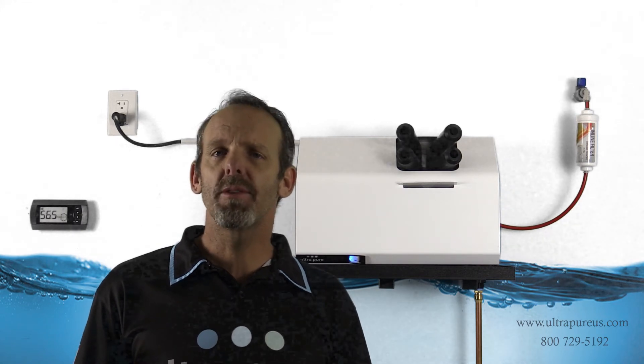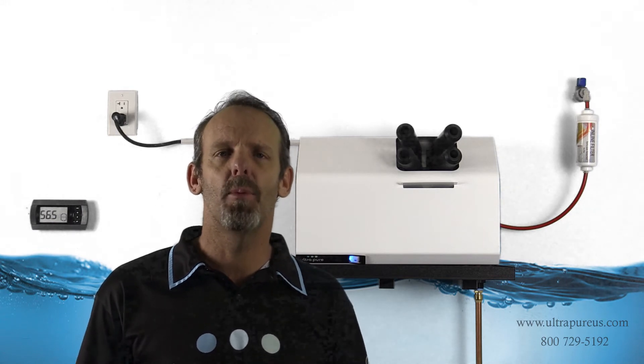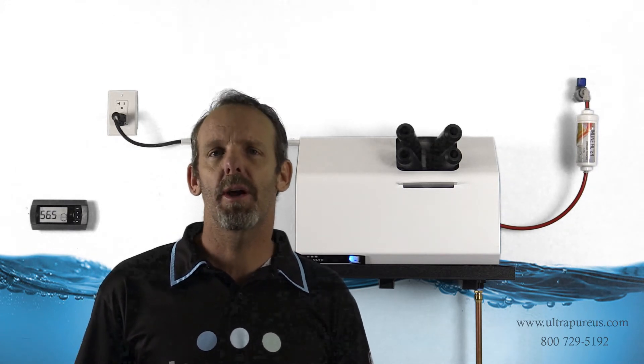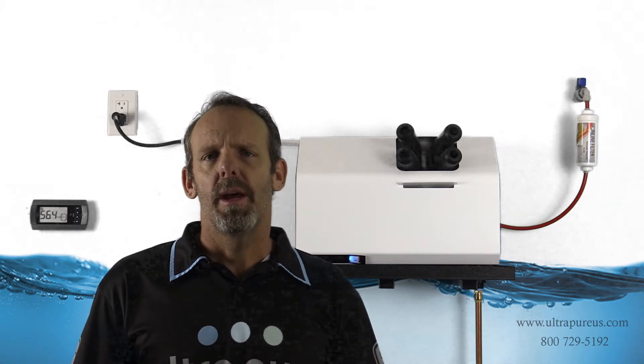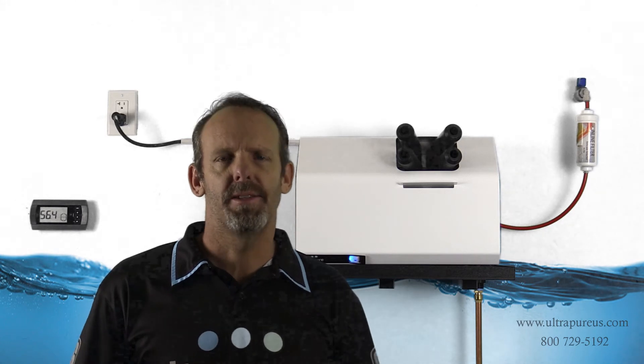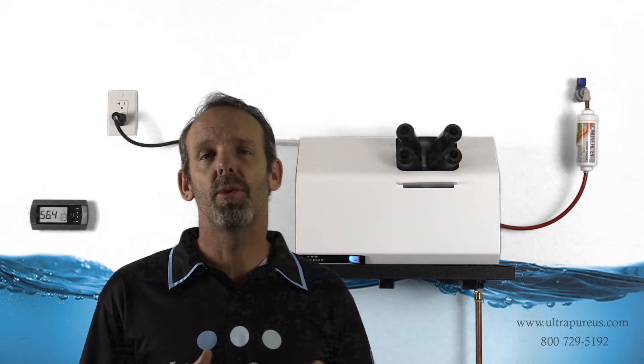Most manufacturers and service companies utilize what's referred to as a type 1 DI resin. Type 1 resin is abundant and it's used in many, many processes and it works great. However, in ultrasonic humidification, it poses a concern. Type 1 resin on the anion bead has a group in it called trimethylamine, and in that group there is amine or ammonia. As DI resin goes bad or is exhausted, the amine degrades, and when it degrades it gets into the water — and that's the problem. When it gets into the water, it gets into the very fine mist, and that's your fishy odor.